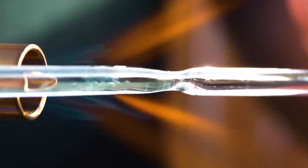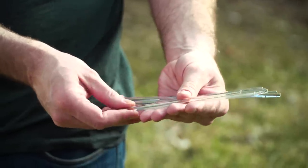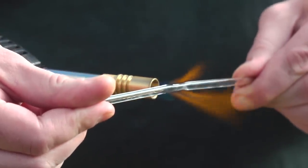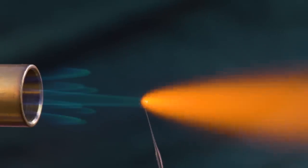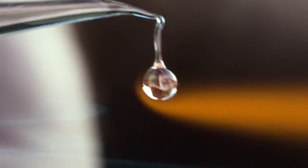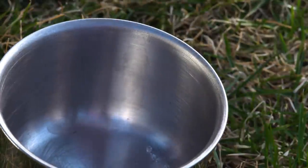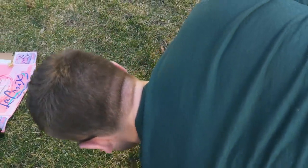The next step to actually making my microscope lens is to pull a thin strand of glass and then melt it into a bead. To practice, I used some glass rods. Heating them to their melting point under a propane torch, I pulled them until they were super thin and then broke off one end. Then I heated that end until it started to form a bead. The surface tension in the glass helps it form into a sphere, and once it's reached the desired size, I remove it from the flame and snap it off. I have to be careful, because if it goes flying, there's no way I'll be able to find it.